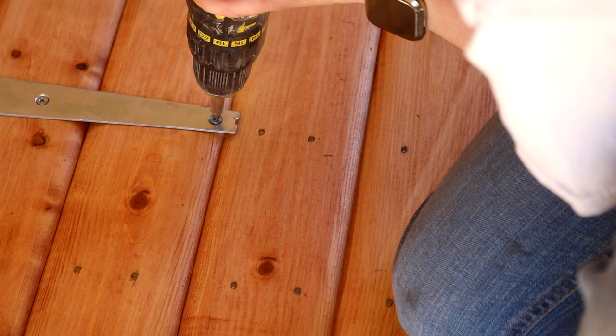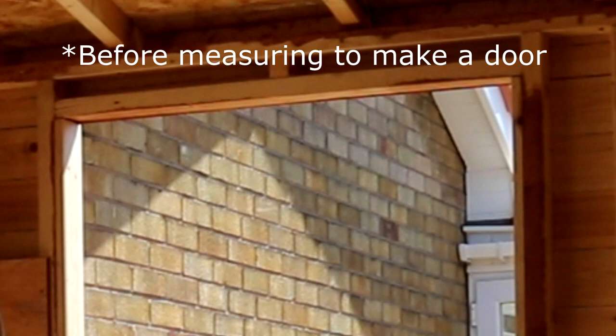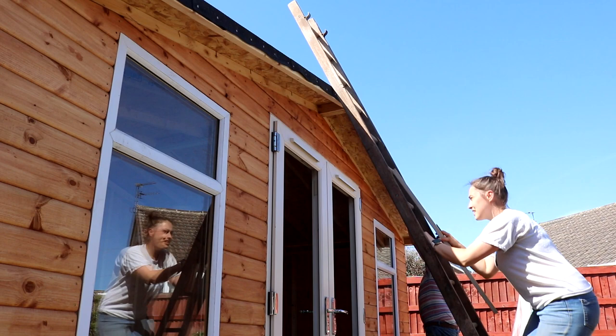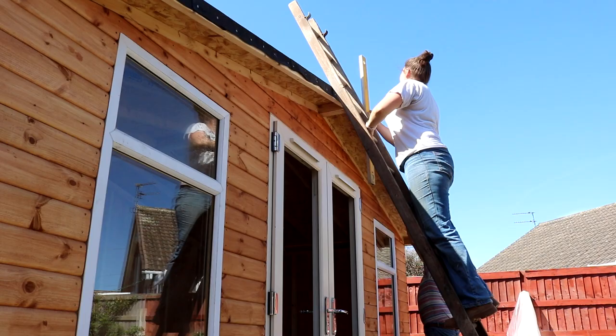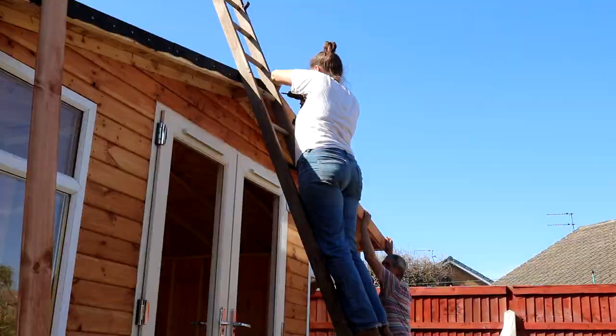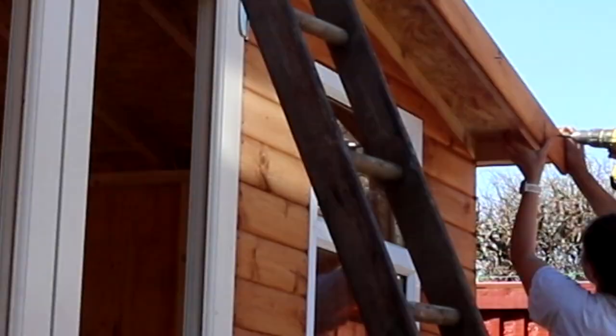For those wondering, yes, I will definitely be adding some bolts later. My dad also added flashings on the shed framework itself, then we lined up the door and I screwed the hinges on and the matching bolt piece. Then we needed to focus on the roof felt trim. We're just using cladding for this, and I cut four pieces down at the same time and treated them. We screwed these across the front and the back in sections. I didn't show the back because I'm a scaredy cat for heights, so I left that bit to my dad while I helped from the lowest side, stood on step ladders.